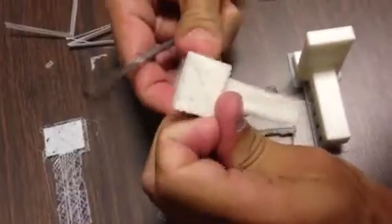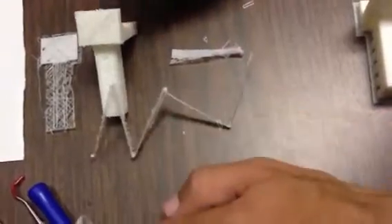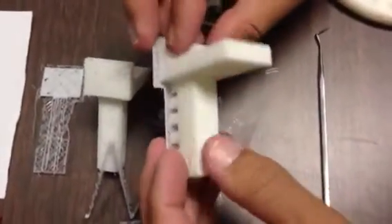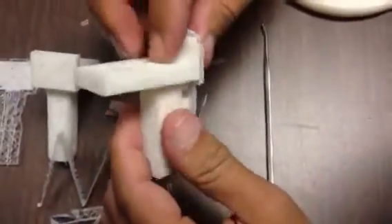It's just like how the Cura one is. We'll let that one go. That's first, second — the support material came off really nice there. Now this is the third one. This is the one I did the manual support layers with. In the print I took the perimeters from three to two — I think that was one setting I changed.